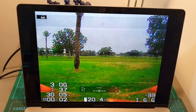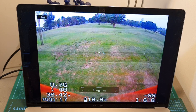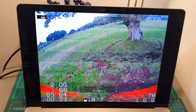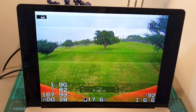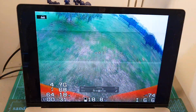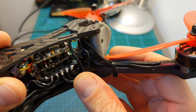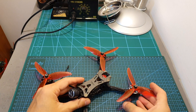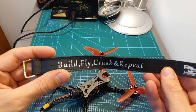On the second flight I used the 5S battery. At the beginning everything went smooth, but after about 35 seconds I crashed the quadcopter. I initially thought it was a problem with the ESC and that it just couldn't handle the 5S battery with a 2207 motor, but I think it was actually a problem with the battery velcro strap — the battery detached in the middle of the flight, which led to a crash that burned the motor. Luckily, after changing the burnt motor to a similar one, everything works properly. It's a smart move to invest in a good battery velcro strap.